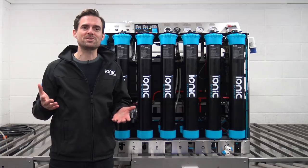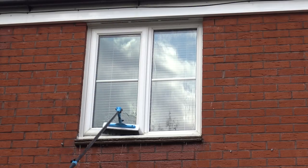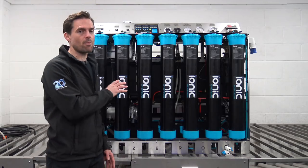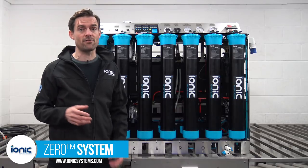To gain good results with zero parts per million water the cleaning technique must be just right, with the best results achieved after two to three cleans. With zero parts per billion water the cleaning results are assured even with less than perfect technique.